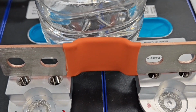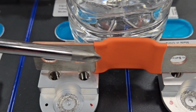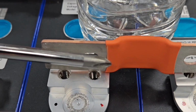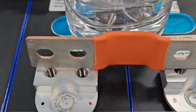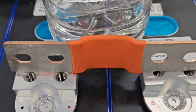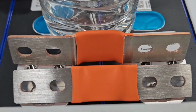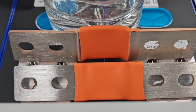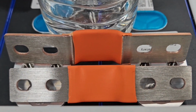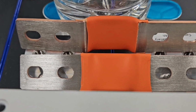So one problem I've noticed here with these bus bars is, and you can probably readily see it, I got it propped up here with a bottle of water, but see that there, that heat shrink is too long. What happens is when you lay it on top of this terminal, it's going to create an air gap in there. We want as much contact area in between the bus bar and the flat surface of the terminal as we can get. So you have to take a utility knife and trim these back so that they clear that battery terminal. All right. So here I've got one that's been trimmed up. You want to cut it past where that curve is there, and you can see in comparison to the one that wasn't trimmed. So get out the utility knife, get them trimmed up. You don't need to cut the top off, just slit it on the sides and get that bottom chunk off there, so that way it sits flat on your terminal.